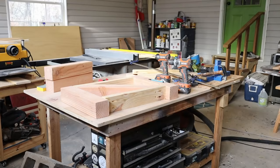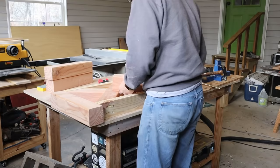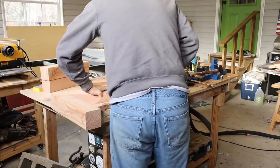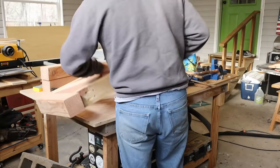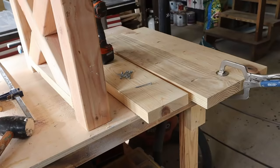On my smaller pieces, I've done the same thing. I'm marking them, setting them on top, marking them, and then taking them back to the miter saw and sneaking up on that cut. You see me several tries here until I get the perfect fit. Once those are fitted, I'll take a drill and four-inch screws and screw from the one side of that long crossmember into the short crossmember, just to hold that nice and steady. The other piece is just going to be glued in and then screwed from the top side or the bottom side, whichever way it's fitted.